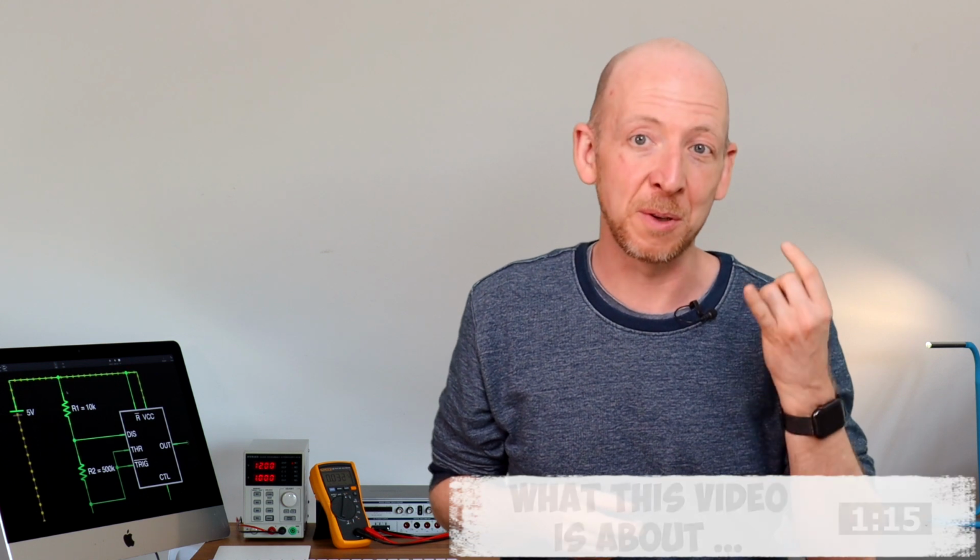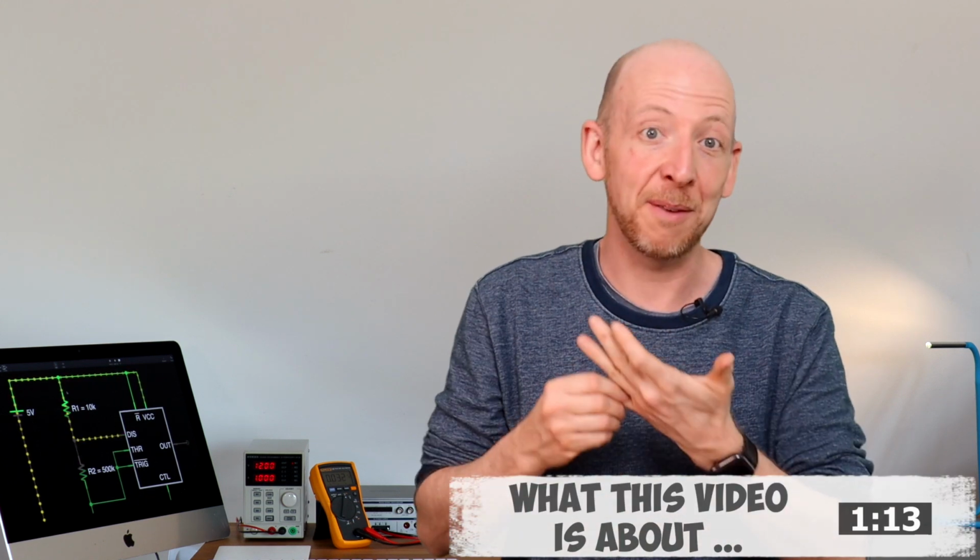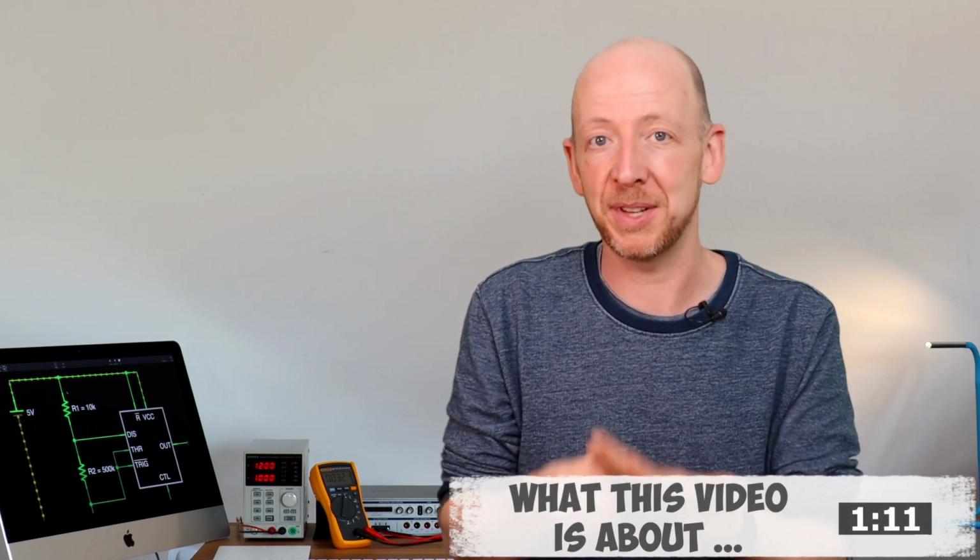In the last video on Ohm's law, which you can find up here, we have seen that the resistance value of a conductor depends on the conductor material and on its geometric properties, which in case of a cylinder are of course the cross-sectional area and its length. Both quantities make immediate sense because imagine an electron traveling through a long conductor, a lot of its kinetic energy and thus voltage is converted into other forms of energy such as heat.